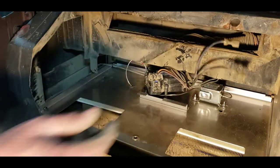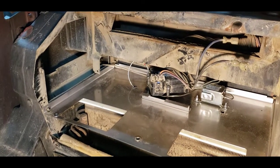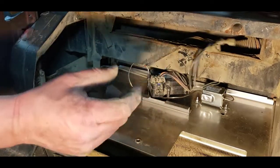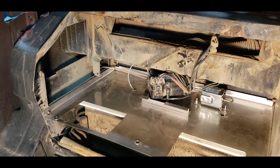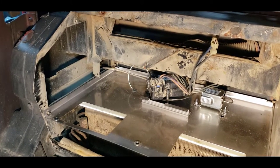Note that our fan upgrade kit accommodates a lot of different trucks, so you may have to put your own connectors on the end of these wires or build a small wiring adapter to make it work properly, because there are male spade connectors on the motor when you receive it.